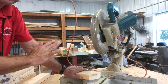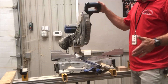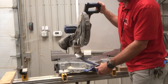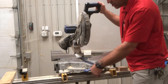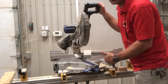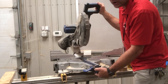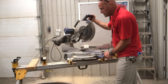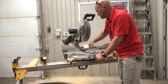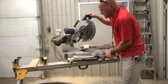Just slow down, take your time, do the job correctly and safely. Also be aware that on different saws the angle lock moves differently — this saw has a lock button that locks it at a certain angle. You need to move that up, then pull up a little button to rotate to different miters. If it's hard to rotate, it might mean there's sawdust from previous cuts hindering the rotation — just clean that up and then you can rotate it freely.